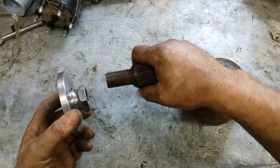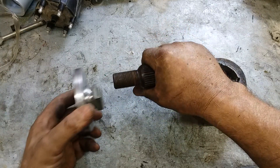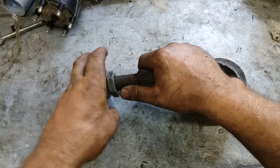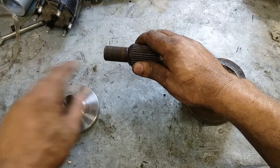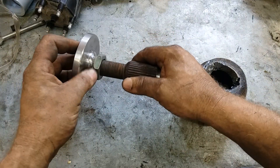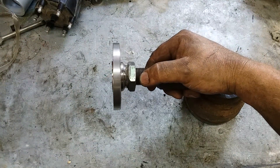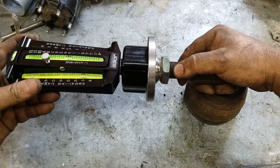So I made one of these. This screws on — here's your half axle, it sticks out through your hub. This screws on the inch or so of threads that's just hanging out here in the wind. And since this is your axle, it's going to be running reasonably true. So you screw that on there and attach your caster camber gauge and do your alignment.